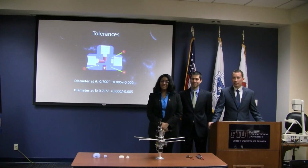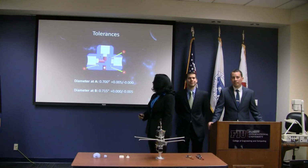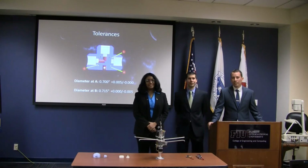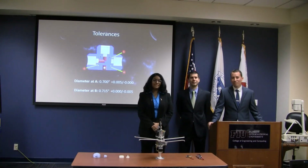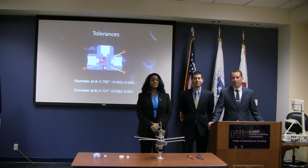Dr. Carnegie? No questions. Yes, please. Just a couple quick ones about your fluid analysis. So you have a tank at 3,000 PSI? It's regulated down to 750. Okay, so you're at 750 still. Can you just comment a little bit on using very standard laminar flow analysis methods for that? As you just said, this is all pretty turbulent flow.